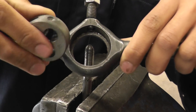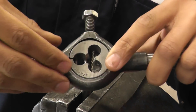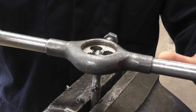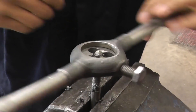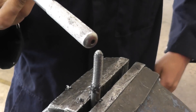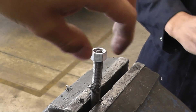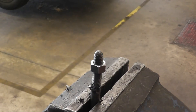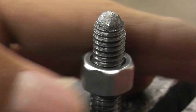When repositioning the die, make sure this groove lines up with the bolt, then tighten your bolt down to close that gap. Make sure to use your cutting lube. Once you've gone all the way down and back up, your nut should fit nice and snug — very little play, and it goes up and down smoothly.